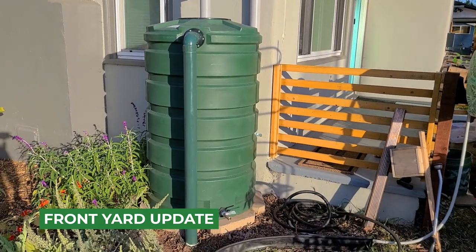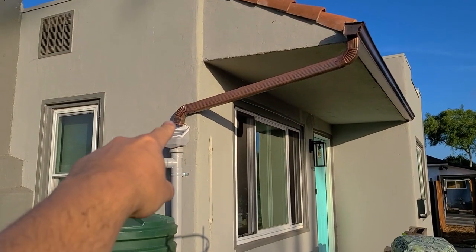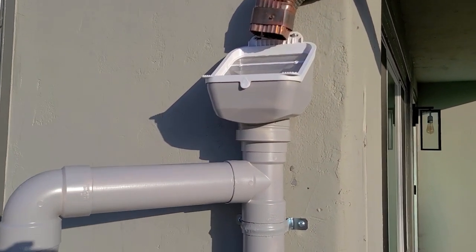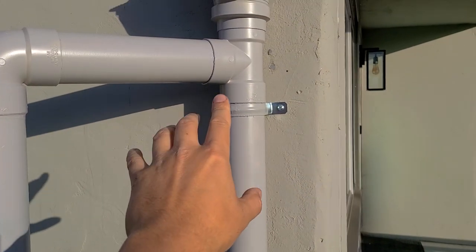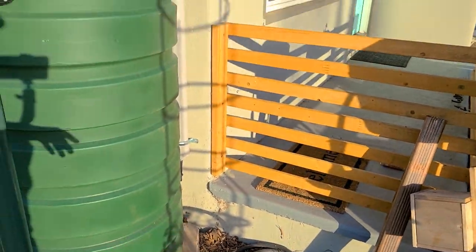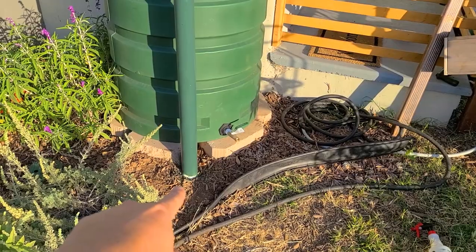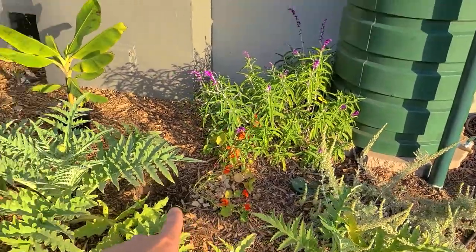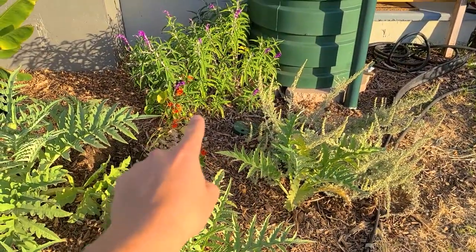I want to run you through each tank and show you how it works. Here's the first one — it's quite a bit larger. This is 200 gallons here. The copper gutter had to get cut just slightly, and we got a nice little expensive piece of copper right there. The tanks all work relatively the same way coming out of the downspout. You have the leaf filter — what's cool is that Brooke and their team actually painted the PVC so it somewhat matches the wall and has a nice clean look. You've got your first flush filter; I can move that water wherever I want, gray water it if I want to. It's dropping right in. There's the spigot right there — we put it on these little pavers so it has a nice base and you can access it easier. The overflow on this one goes into our gray water laundry bed — that little PVC routes into the laundry system right here. So if we ever overflow here, we're still going to route in and get a double passive watering.